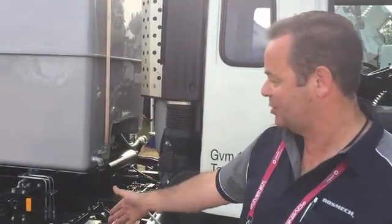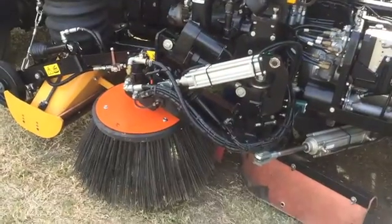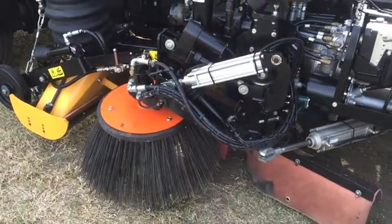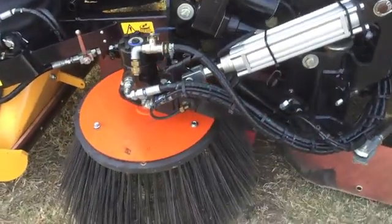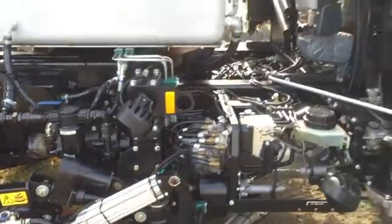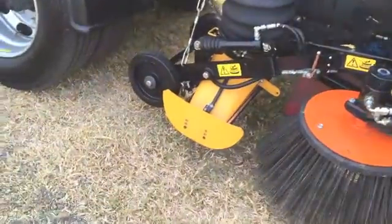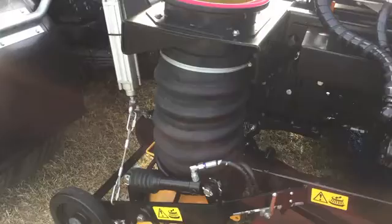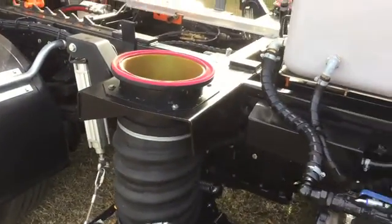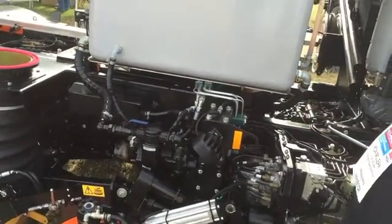So we've got our channel brushes, which have power down, power up. Although what is very good on these models, we also have an ultralight sweeping mode. We can actually lift the brooms if there's not much on the ground, or if we had a raised curb, we can actually raise the broom to go into that area. Our nozzles are the same as any other suction sweeper configuration. With options, we can add high pressure water to the front, to the rear. It has what we call a gobbler, which is for raise and lower, for taking larger product in the uptake tube. But the big feature of this truck is, as I said, no engine here.